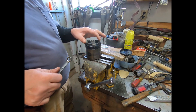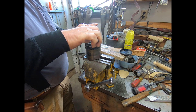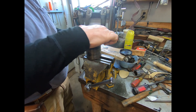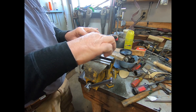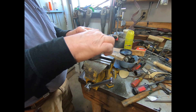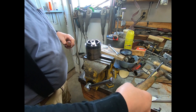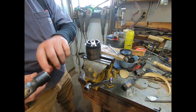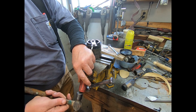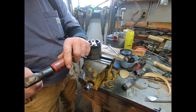Okay, I've been looking. I've got the new leather cup on there. In all the manuals and all the stuff, they might give a spec for the torque on these little bolts — they're not very big, they're 5/16ths and they're non-hardened. Probably not much more than 10 or 15 foot-pounds. I'm going to say that's good enough. Then, without staving up the new piston, we'll tap these up.